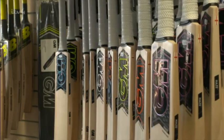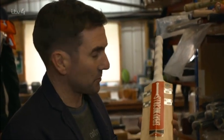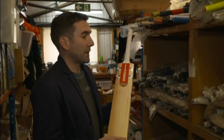If making a bat for a world-class batsman like Shivnarine Chanderpaul, his bats are 2 lbs 8.5 oz with at least 13 grains across the face. The blade is a quarter of an inch longer than standard, the handle an inch shorter, and the weight is right down in the bottom of the blade — he also likes a redwood edge on his bats, and it's done him pretty well; he's one of the great test batsmen of all time. In comparison, Alastair Cook pretty much takes a bat straight off the shelf as long as it's the right weight — about 2 lbs 10 oz — and if it goes well, he's happy.